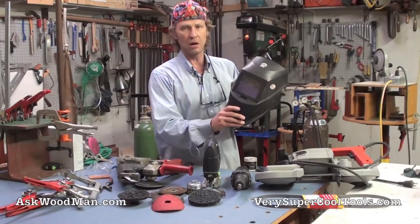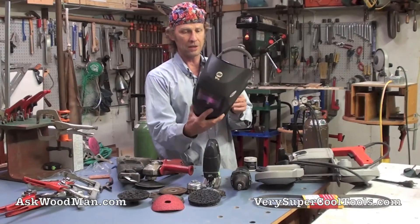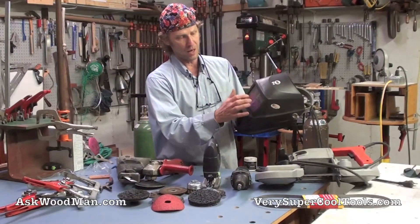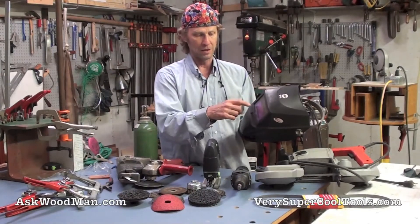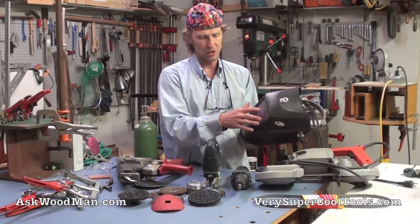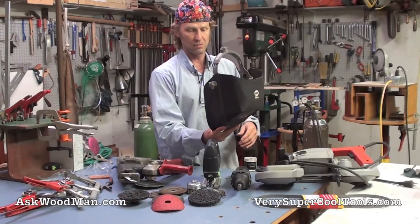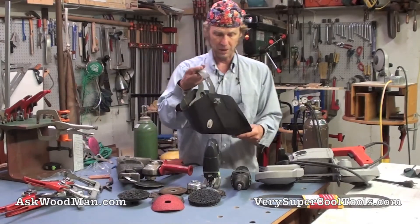You'll also need a welding shield. This is what's called an auto-darkening welding shield — nothing fancy, about $85, a Miller Pro Hobby. It's really light and comfortable. On the inside I have a one-diopter cheater lens to help me see a little better. The protective piece of polycarbonate on the outside is a disposable cover you just pop off and replace, depending on how much you're welding, because the BBs and fumes will cloud and damage it. This protects the sensor and permanent part of the hood. I have no complaints about it at all.